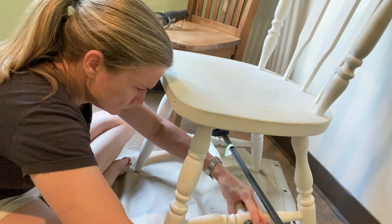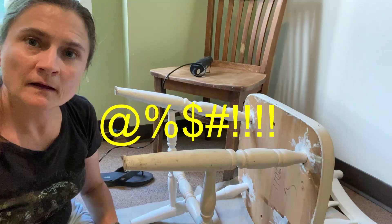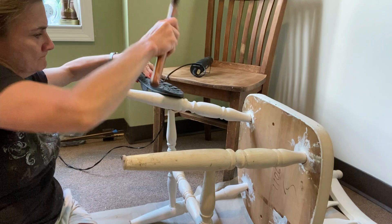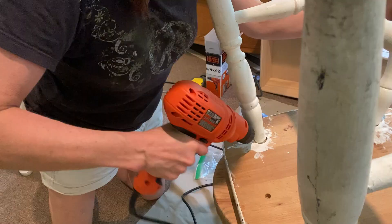Okay, that's not going to work. How in the world do you put a clamp on a spindle chair like this? So here's the next best thing — I'm going to take my flip-flop. This is the piece that I glued. Looks like a tight fit to me. Each leg has a screw that goes in, and what I'm going to do is secure each leg with one more screw, just opposite what's already there.